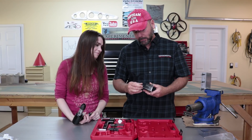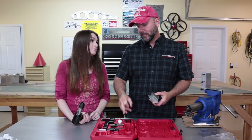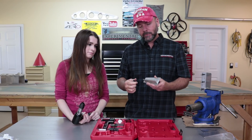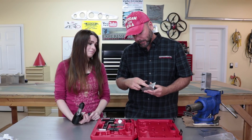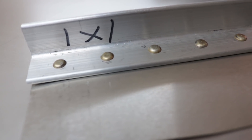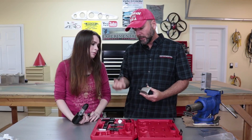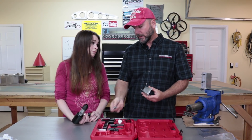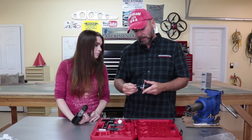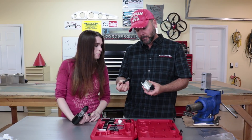If you choose the wrong size tool — like I did on purpose — what it will leave you is what they call a 'smiley face.' The smiley face is usually referred to on the skin when doing flush rivets, but you can also have them on the rivet head itself. As you can see, the tool didn't quite cover the whole head and it left an indent on the rivet. So make sure the selected tool covers the entire rivet head.